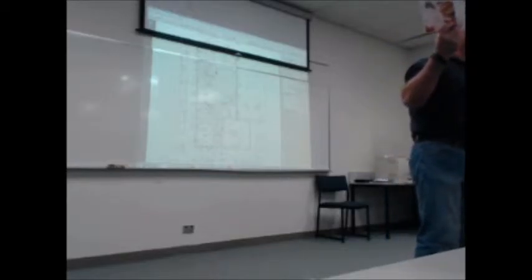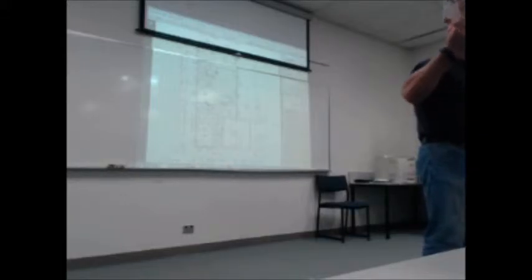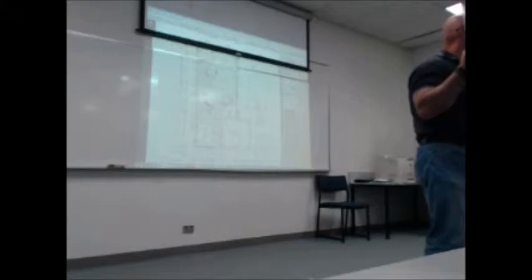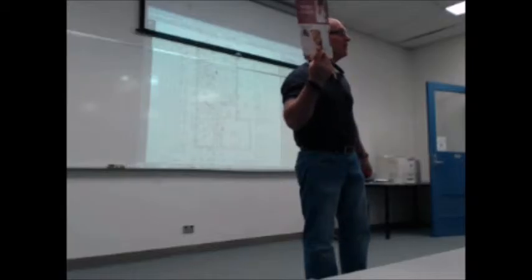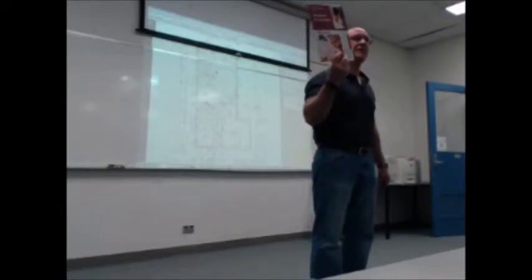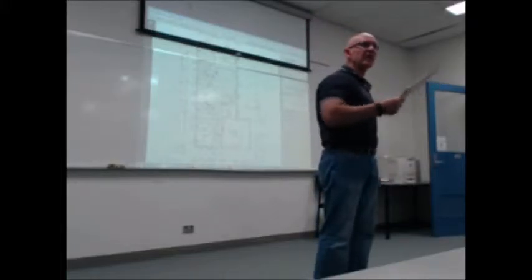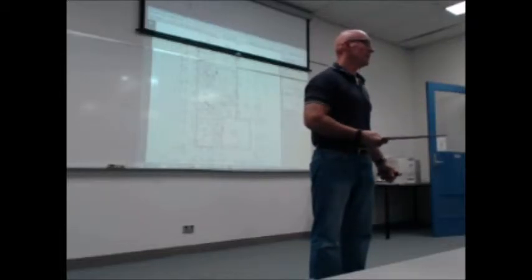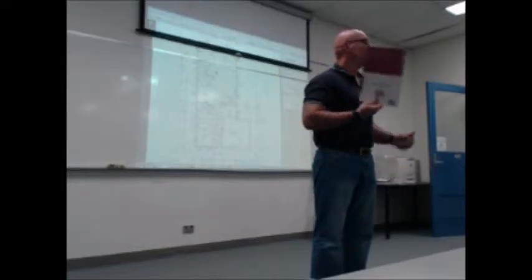There's a multitude of standardized booklets you can get from HIA and MBA. Yeah. I would always carry one of them in the car. Variation. You never know when you're going to get hit for a variation. Act on it straight away. Variation contract, the duplicate. You fill it in there and then. It doesn't have to be a fixed price. It can be a provisional sum, or a PC. You get the client to sign it. You give them their copy. You've now done the legal thing. If you do the variation without that in writing, technically you don't have to pay for it.